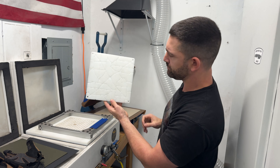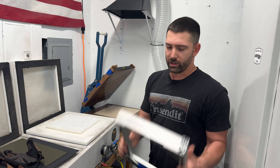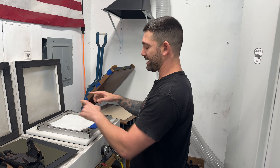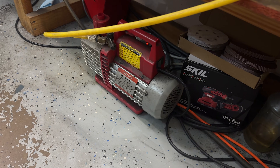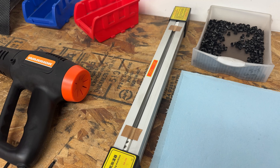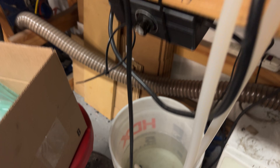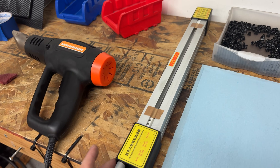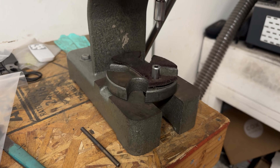On the back side, I connect all those holes into a little grid pattern, and the table here has a grid pattern as well. We also have this piece of aluminum extrusion — you just need this to cover the top of the Kydex once it's on there and it'll create a seal and pull the Kydex down. Connected to this table you're going to need a vacuum pump. Another piece of equipment you'll need is this heat strip, often called an acrylic corner bending machine — you can get these on Amazon, and it has a heating element that runs in the middle. This one is water cooled and comes with a pump so the aluminum itself doesn't heat up. You'll need this to heat the center of your sheath if you are doing a split type mold. You'll also need some type of eyelet setter as well as your eyelets.